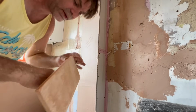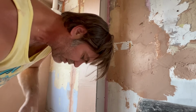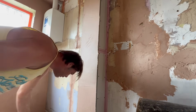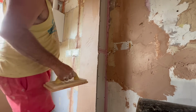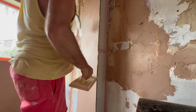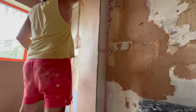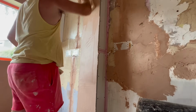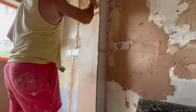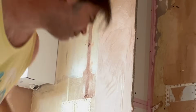Okay, here's the cheat here. Using a sponge float. Look at it. It's a fine sponge. It's not as coarse as some of the ones that you get for sand cements, and I find these ideal for cheating with multi-finish. So if we look at the state there as it is at the moment, and like I say, I'm having to move fast because we're kind of losing it, and what we're doing, we're using the sponge float, plenty of water, and it's doing 2 things. It's livening up that very surface, and it's also buffing out that surface as well, taking out ripples, filling holes, etc.